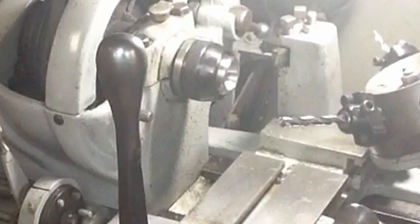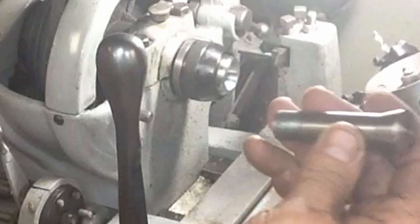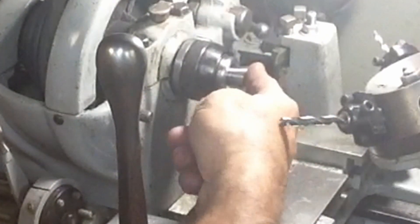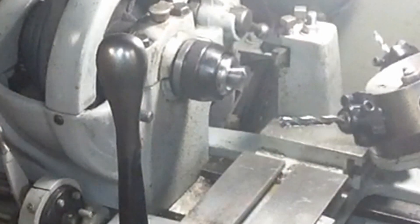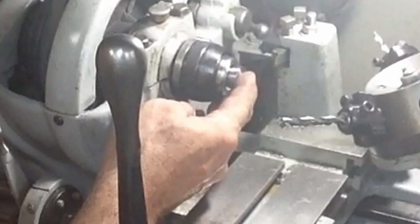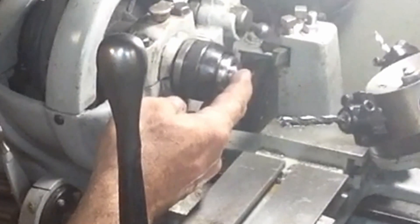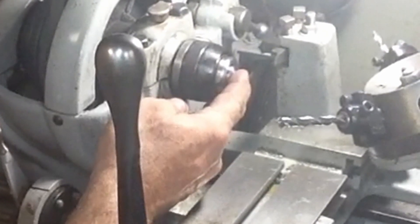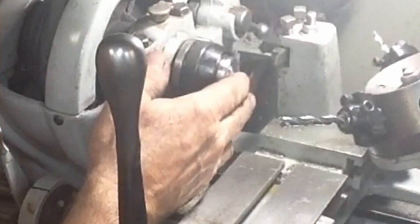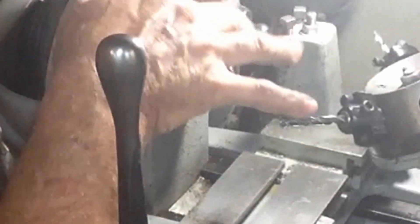I'm going to fit each of these up and center drill them so we're ready. It'll act as a counter bore too. This first one's going to be 3/16ths and I've already set it up for that. I had put the half-inch collet back in and set a piece of scrap in there that I faced off, so I went ahead and centered up these tools — they should be set and ready to go with the exception of depth. We're probably going to start with this little one over here just because it'll give us a good center point without wandering too much. This is a 5/16ths.